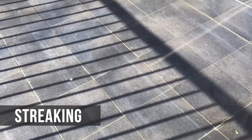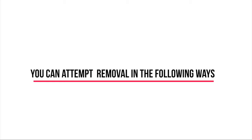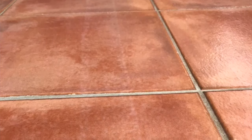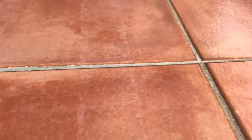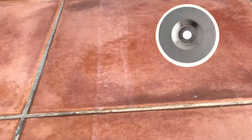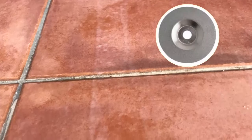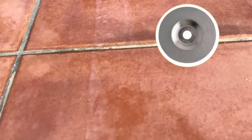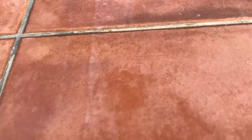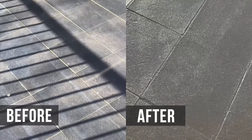The membrane is classed as a permanent application that cannot be removed after full cure. Using a sharp disposable knife, cut around the section and remove it. If you have terracotta or stone, you can use an Aris or polishing blade and grind the section after full cure of the membrane, but be aware that you may end up taking some of the tile off, which is why you cannot use this application with other kinds of tiles. Alternatively, you can paint over the membrane using a normal external paint and then reapply the membrane over it to check it.